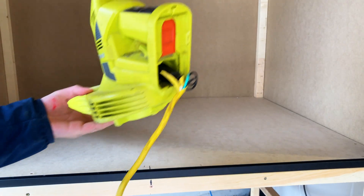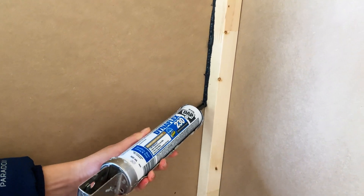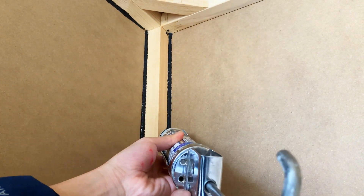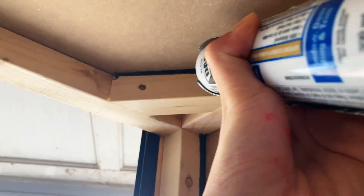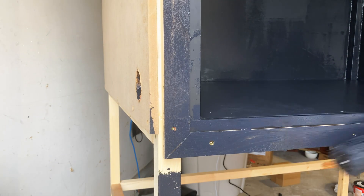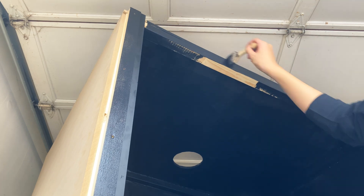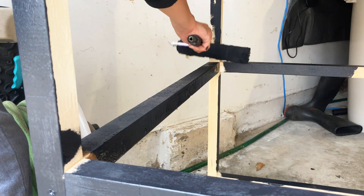There's been a lot of steps already, but now what I have to do is put on adhesive silicone glue bought from Home Depot onto each of the edges where the fiber boards meet. This helps keep our fume hood airtight and maximize the airflow at the opening of the sash, but honestly I could have gone without it — I'm not sure how much it might have helped the fume hood. It kind of reminds me of frosting a cake. After waiting another day for all of the glue to dry, I can then start painting on a matte layer of black paint I got from Home Depot, starting off with the corners and frames with a small paintbrush, then working my way towards the larger surfaces with a big paint roller. Some of the outside, like the legs of the frame, were also painted in black. When this is all dry, I can put on a second coat of paint just to make sure that everything was nice and covered with a good seal.